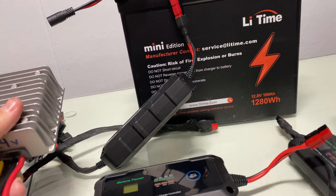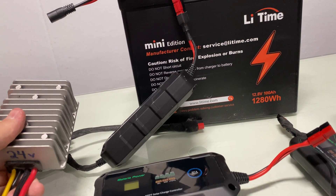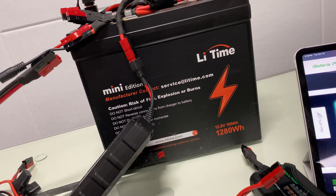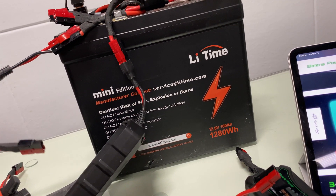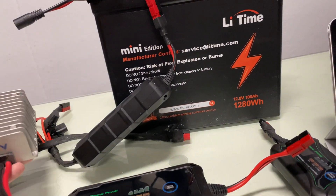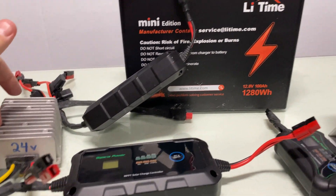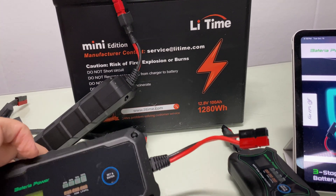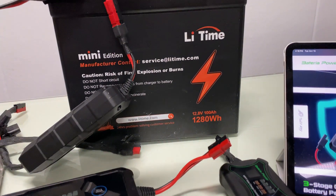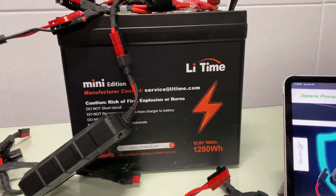I have a UPEZ 1,000-watt solar generator — it charges only a maximum of 200 watts per hour. So you have to watch what you're connecting on this end if you're going to up-voltage it. This is the way you can charge a 12-volt battery with a 12-volt battery by raising up the voltage. This unit takes the higher voltage and steps it down to 14.2 volts to charge the lithium iron phosphate battery.